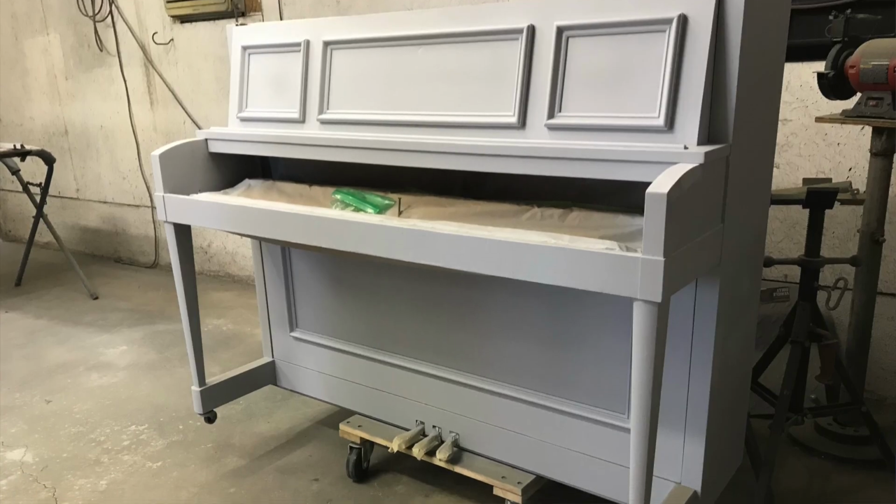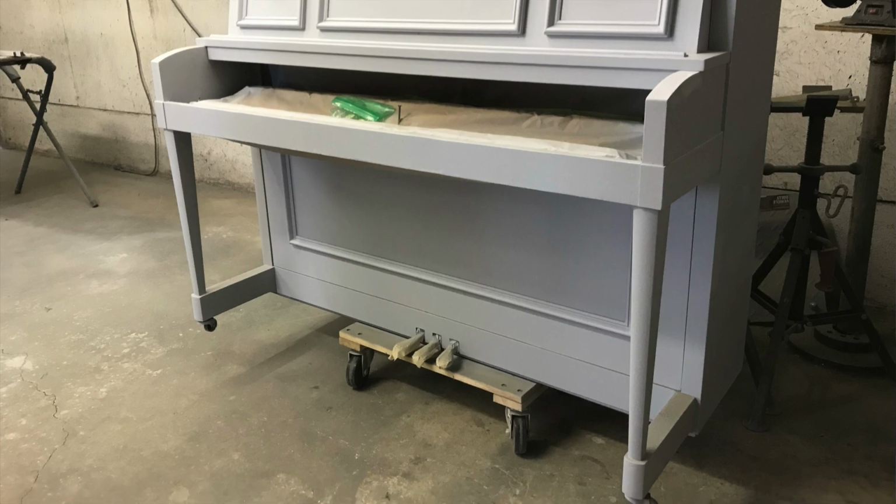This primer happened to be the $100 type of automotive primer, whereas some automotive primers hit $500 or $600 a gallon. But in this case, all you're looking for is something that's going to fill in the grain really nice, stick good, and provide a good surface for the paint color to go on. And that's what we did here.